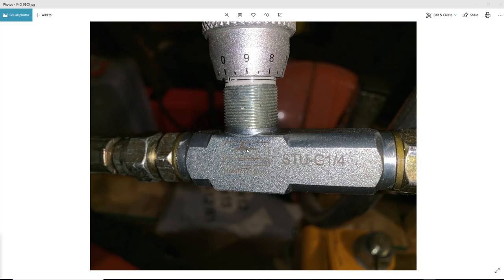Looking at this right here, you see this little arrow, there's like a little V here — this is like a spring — and this is the flow valve. What this is telling you is when the fluid is going in this direction, it's going to restrict it. This dial will control how much flow, and it forces the bypass to be blocked. When you see this arrow kind of on a slant, it's telling you the fluid going this way is restricted; going the other way, it's unrestricted.